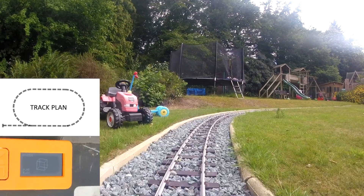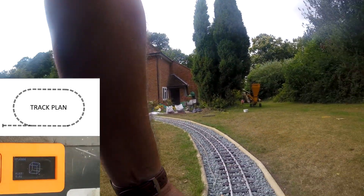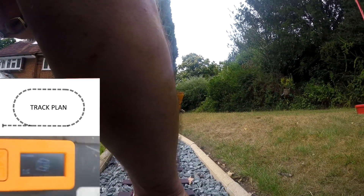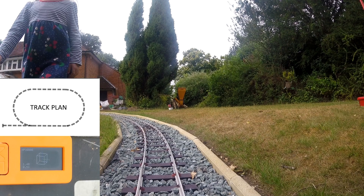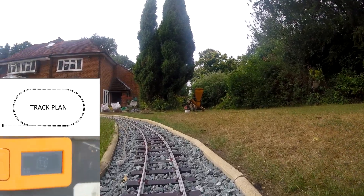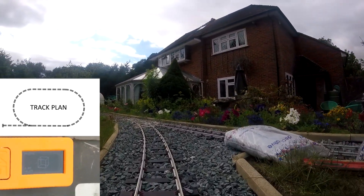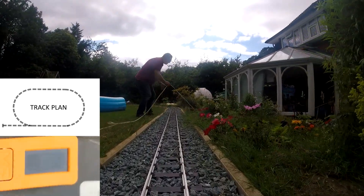I'm coming up to the end of the clockwise loop now. The reading here at the point of stopping is about 0.2 to 0. I'll put the loco around - minus 0.2 to 0 - and place it back on the track. After faffing around putting the wheelsets back on, I'm getting 0.4, so I'm nearly half a degree or so biased between the clockwise and anti-clockwise measurements - that's to be expected. But I am quite alarmed at the variability and noise in these signals; it's proven to me that this is not actually reliable unless you do some fairly sophisticated data logging and averaging. So as a project prototype, not particularly useful.